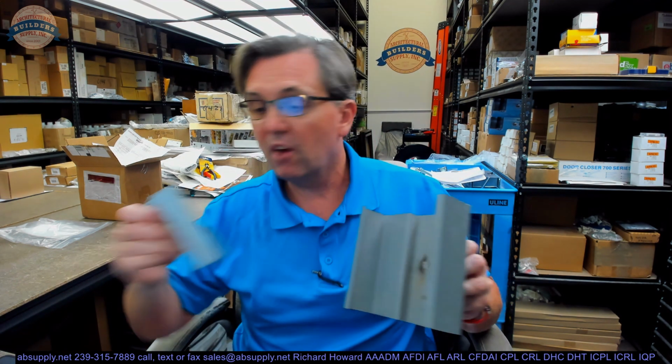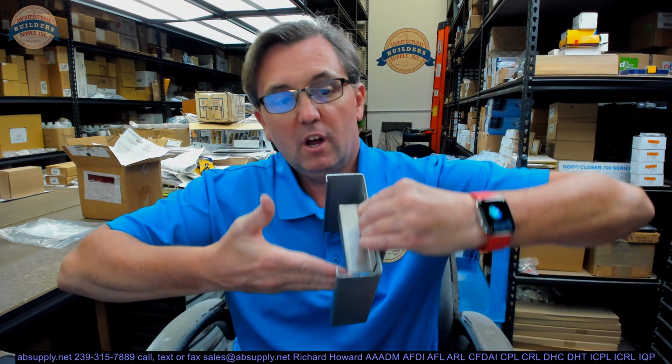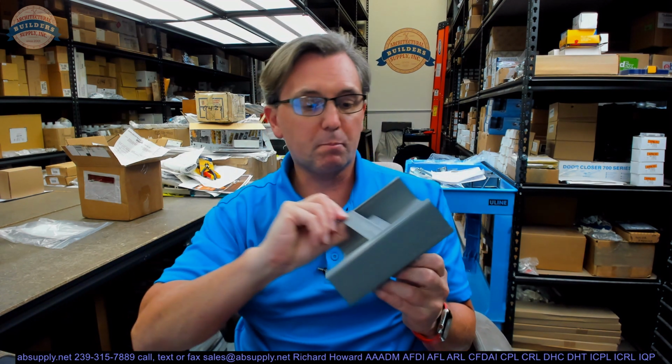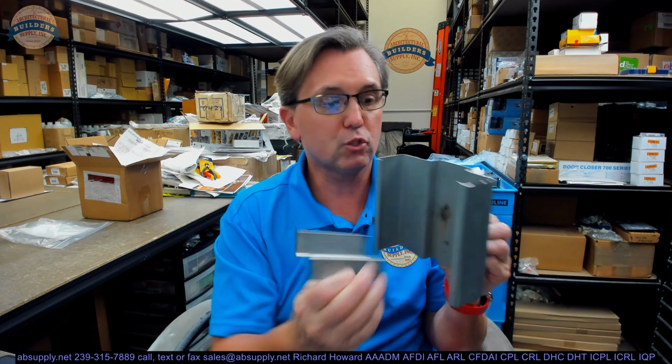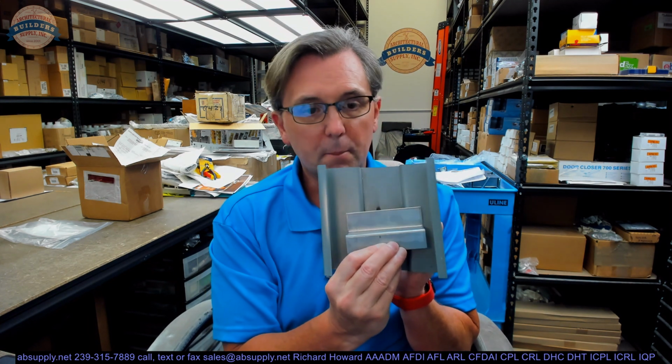But when you weld this in, the FR290, you must do it in such a way that you've done it correctly. And what I mean by that is you have to have the area for drywall to get inside of here, and to have a fire rated opening, you have to have 1/2 inch of penetration of drywall. Now, someone in the know who's doing a fire door inspection, auditing fire doors, can stick a probe back there and determine if you've got a 1/2 inch of penetration in the back of the frame. So be mindful, that is cut back like that to give you that 1/2 inch. You can shoot that drywall basically all the way to the rabbet. Don't touch the rabbet, you'll mess with the frame, and its integrity of being true, plumb, level and square. But that's what it's going to look like.